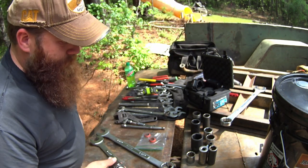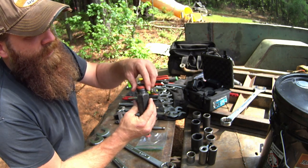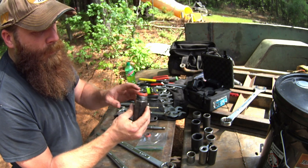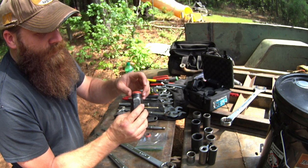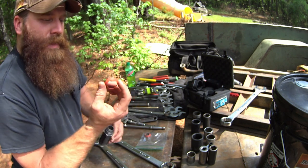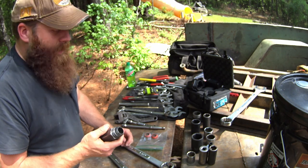You can't get them to seal up right. FlareSeal makes this little cup right here that will actually sit on and create a new sealing surface in a lot of cases — I'm hoping this will fit. It's a chunk of aluminum or copper impregnated with some kind of hard gasket-making seal. This is the same stuff my Cummins gaskets are coated with and they work really well. These things are not cheap — about $10–$15 a piece. Search for FlareTite or FlareSeal online and you'll probably find them.